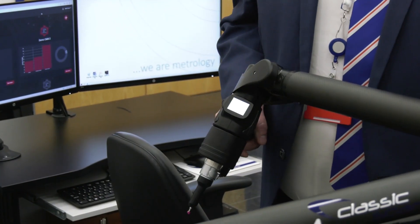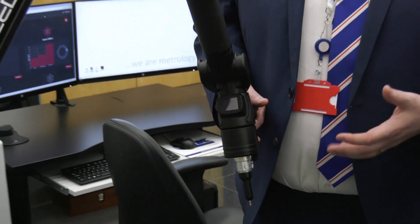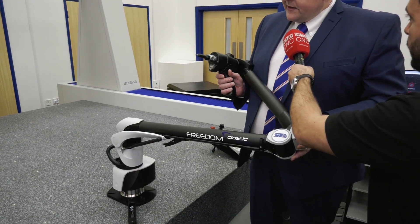So is it all about the flexibility and the time-saving? Absolutely. CMMs generally have pre-planned work on the machine, so when there's a crisis and someone needs to measure something quickly, it's difficult to strip down the machine to put a part on there. But if you've got an arm sat next to the machine, you very quickly put it on the table and start measuring. There's no programming required — you just literally switch it on and start taking measurements.